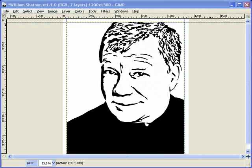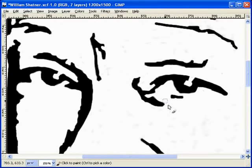After you've printed it out, bump the opacity back up so that it's black again. Usually I print out a copy of the pattern at the exact size I intend to cut it. Then I'll grab a red pen and go through it, circling little areas that I think might be a little bit difficult to cut — maybe something like a little peninsula here that might be a little too tight. I'll go through the entire pattern looking for areas where I need to thicken up the bridges, remove certain peninsulas, or find any other problem areas, and then come back and fix it in the pattern.